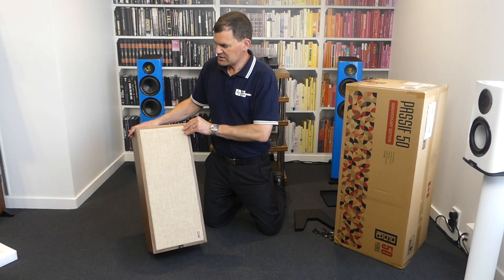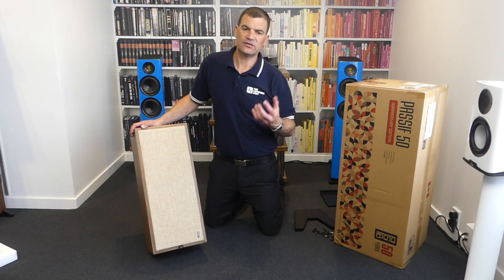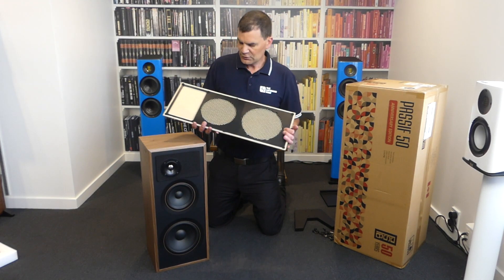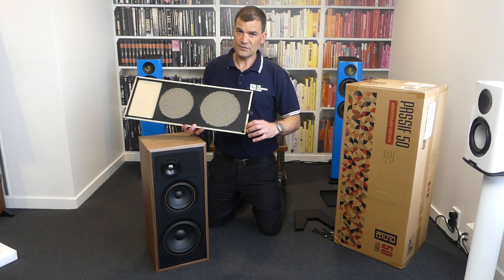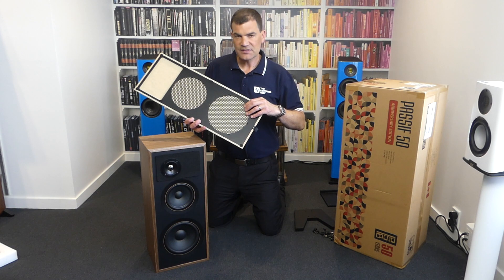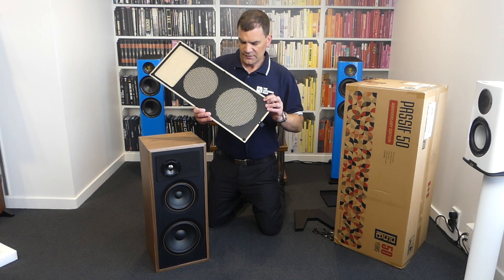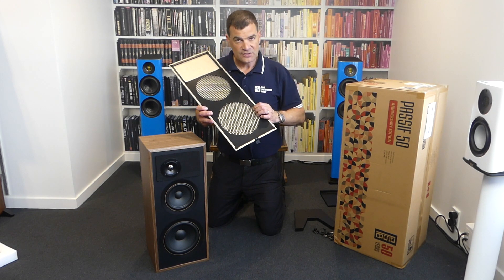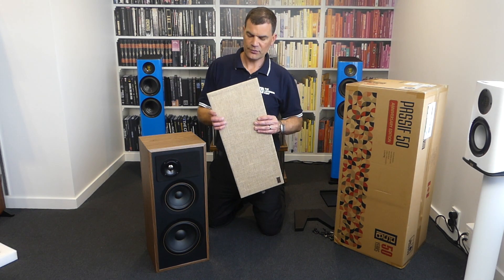Touching on the retro design, there's a light brown woven grille with the PSB logo in its retro styling. At the bottom is a pull tab used to remove the speaker's magnetic grille. Looking at it closely, we see modern techniques: neodymium magnets with a felt pad to prevent scratching the front baffle, and reinforcement shapes to ensure the grille sits flat and flush and doesn't move with driver dynamics. There's also a subtle tapering of the grille so that frequency dispersion is better managed in the room, along with an acoustically transparent patch cut away to minimize coloration through the grille itself.